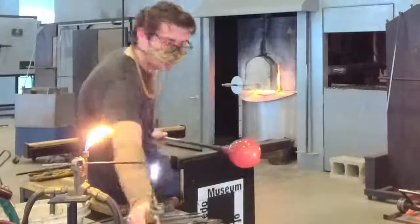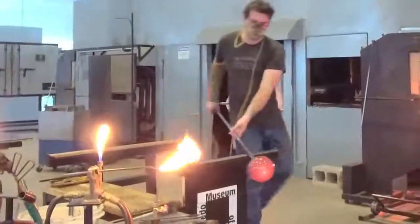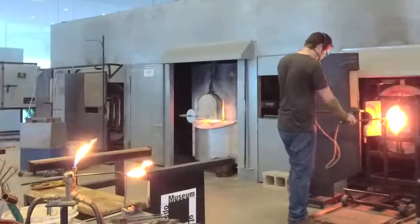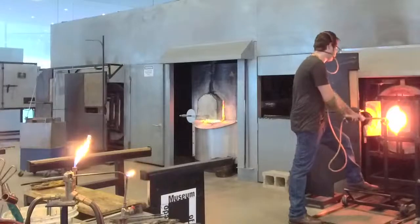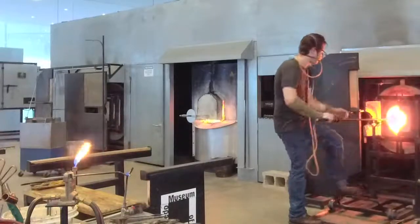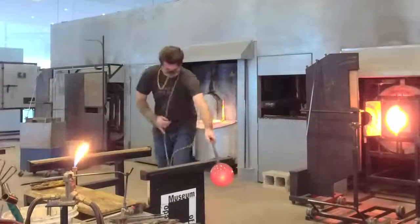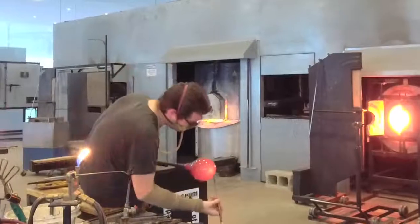You can see and respond to the glass, but seeing and then responding takes a lot more time than physically feeling it through your hand. Misha's just got his hot torch — if he just threw it in the reheating chamber, it's going to heat too much of that area. So he's just going to heat the part where he wants to make that indent. He has a nice pick — just a steel pick. Steel, metal — it could be really anything.